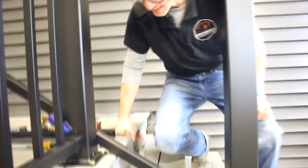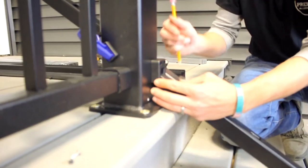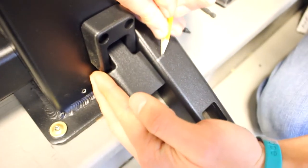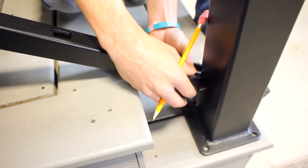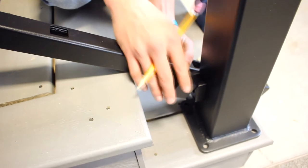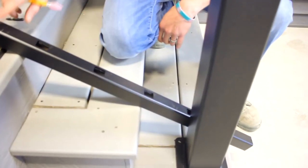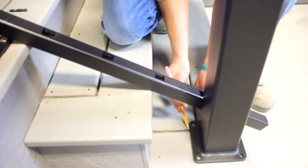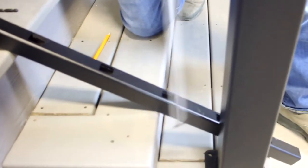Now that we have our brackets assembled, come back to our railing section and place the bottom brackets with the post mount flush up against our post and the bracket flush with our bottom rail. Mark back to about an inch inside of the bracket and mark our rail there, then mark the top side of the rail with a T so we know it's the top section. Repeat the same step on the other end: post mount flush against the post, top of the bracket flush with the rail, come back about an inch, and mark this side as the bottom. Now that the bottom rail is marked, before we remove it, we'll trace on our deck where the bottom post is going to be placed. Then take our tape measure and measure from the bottom of the bottom rail up 38 inches on our post — this is going to be a cut line.